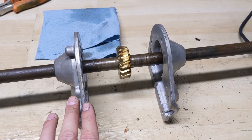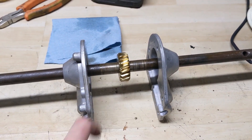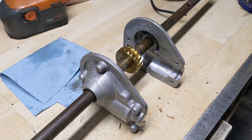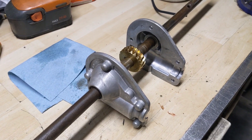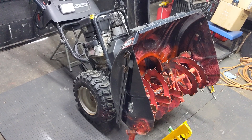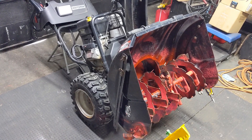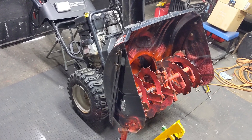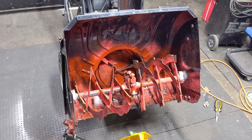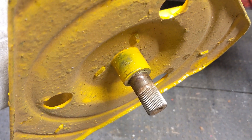It also cracked and destroyed the gearbox housing, which is cast aluminum — also a soft material. For this snowblower we had to buy two brand new gearbox housings, a new brass worm gear, and clean up the shaft. Work like that is very expensive — not only are you paying big bucks in parts, but I quote a minimum of two hours on a job like this. To repair the gearbox, you first have to separate the auger housing from the back half of the snowblower, then remove the internal auger assembly — the first and second stage — from the auger housing.